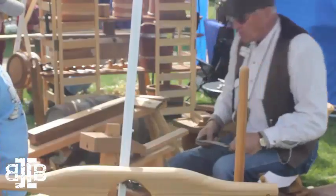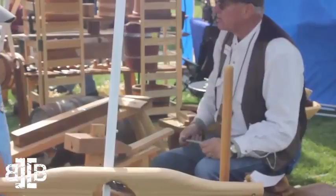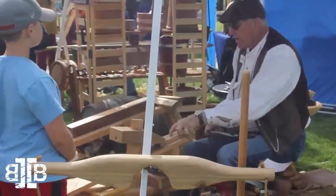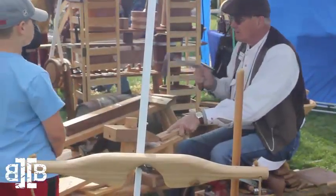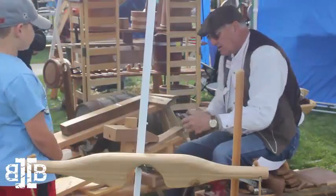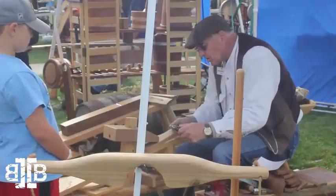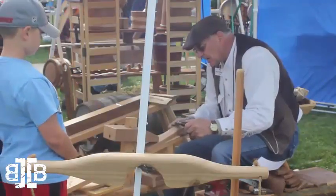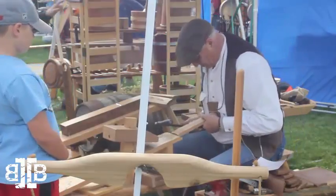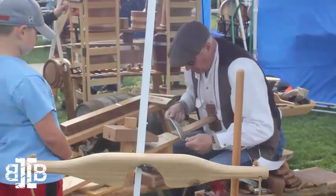So two primary things for a woodworker is having sharp tools and knowing how to work with the grain. Well, I'm working with the grain in this direction, but I can't keep working at this end because that's where I clamp. So how do I get it? I flip this around and give myself a sharp angle to define the curve because I can't see that line when I flip it around. And then I put it on the shelf and use my chest to hold it in place so now I'm still working in the right direction with the grain.